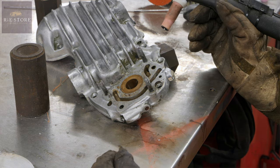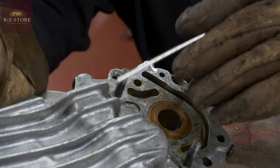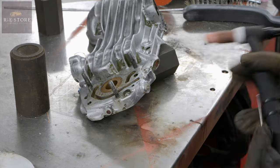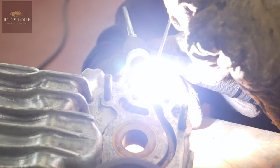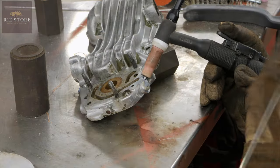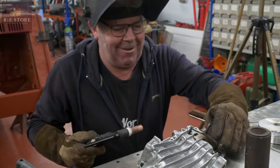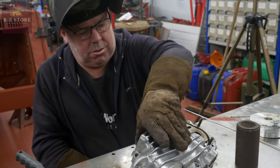That's gone over onto that, which is what we wanted, because there was a slight dent in the casing here — I've just blown that over very slightly. Let's get it where I can weld that, let's come round to there. Don't stick the tungsten to the end of it though — it doesn't work when you do that. It makes it jolly hard to grind down as well, but that's taken alright, which is good. So let's flip him over.